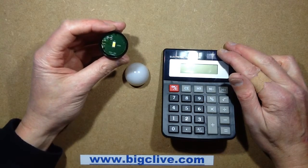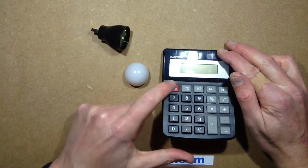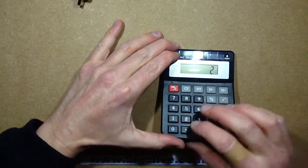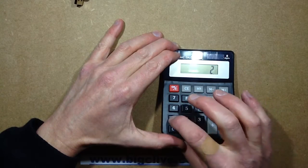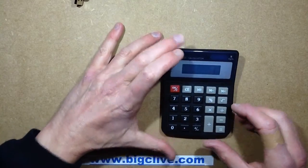It's a gallium nitride LED, so it's going to be about 3 volts drop across that, with a 5 volt supply — so that leaves 2 volts to drop across the resistor. 2 divided by 13 equals 150mA — right enough.